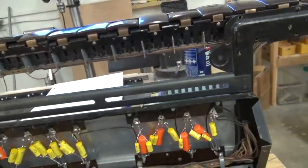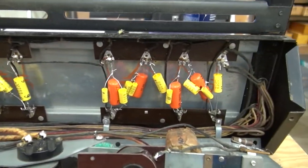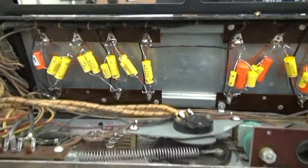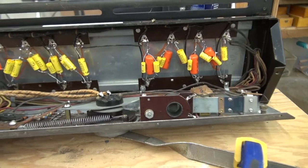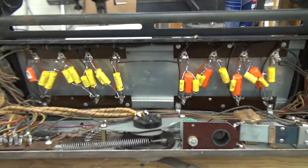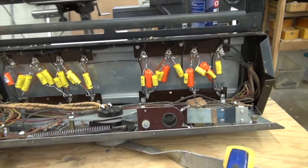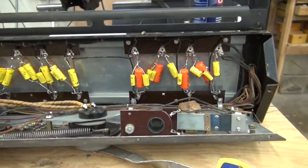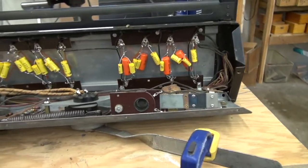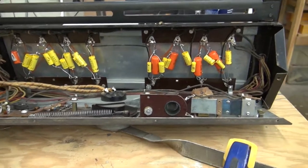The tuning of each note is determined by the capacitors underneath the keyboard in the keyboard unit. It took a long time to figure out how this worked, but the basic thing is it's pretty much the exact opposite of what I would have expected. There are 12 sets of capacitors, one for each note. The master oscillator of this machine is always running at B — the very top note.